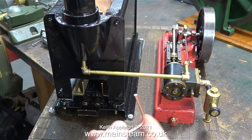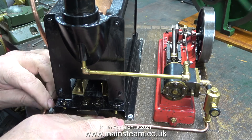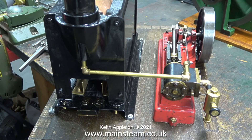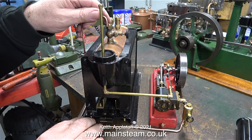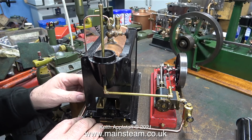Here I'm planning the pipe layout for the steam inlet from the boiler. Normally for the steam pipe to a small engine I would use 5/32nd of an inch or 4mm diameter copper tubing — note to self, buy some 4mm copper tubing because I've run out. This copper tubing is 1/8th of an inch in diameter and it's a bit small, but it will be fine for this steam plant.